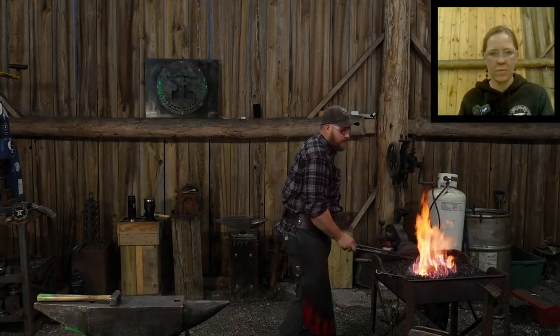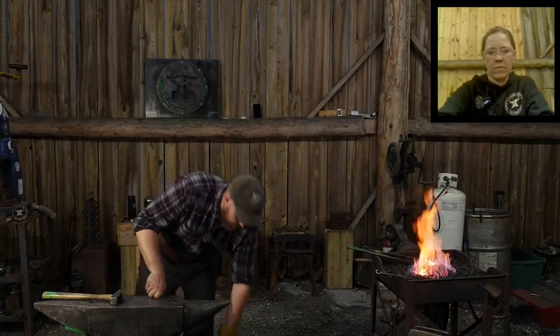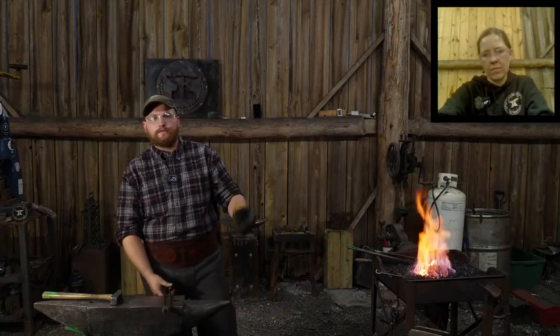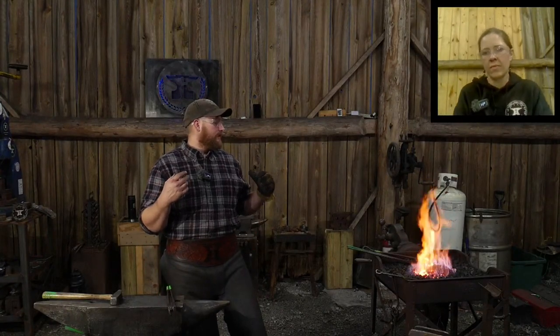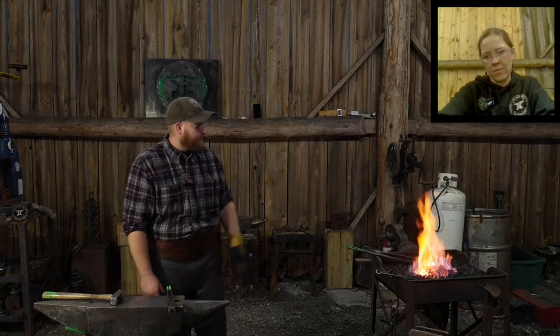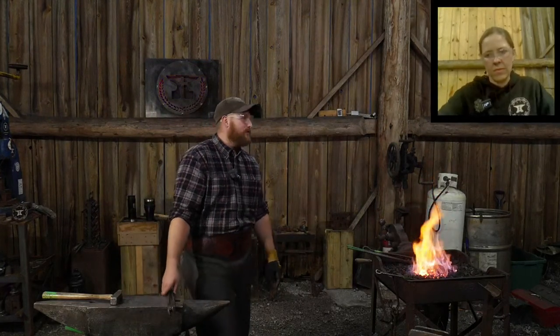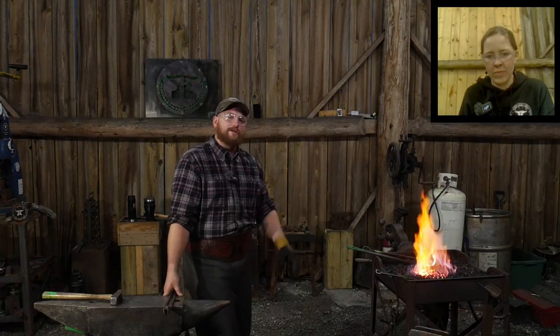I'm not out much if it doesn't work, doesn't weld up. I'll change tactics and go again a different route. I don't have the set tools and the things to do it properly. That's why I didn't attempt it this evening. This was kind of spur of the moment yesterday. I said, you know what? I want to try forging a little Scandinavian camp axe, just something to take with you into the woods, or a little belt axe. I don't know if you'd say the proper way, but the one way that I was wanting to do it was leaving a thicker pole, something that I could weld a bit to in the back, and basically doing a draw away method, so hollowing it out where the eye's going to be, and then weld up the blade and the bit. But we're doing it this way. We're trying it out. We'll see if I can't get away with this. Eventually, I'm going to make a much larger axe. It'll be like a broad axe, and so I'm still deciding how I want to do each individual step.